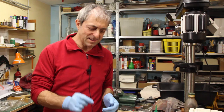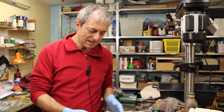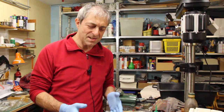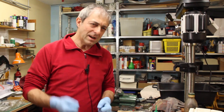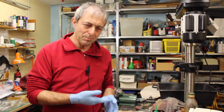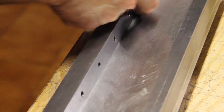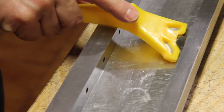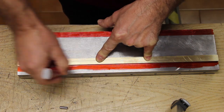I didn't notice that I had embedded a grain of dirt within the epoxy, and one of the parts did not go as well as expected. Since the epoxy takes about one week to cure completely, it was enough - a good hit with a hammer made the parts detach and peel off the epoxy with a knife, then start over again. Here is how it went after gluing, and with this knife tool the excess can be removed before the resin hardens completely.